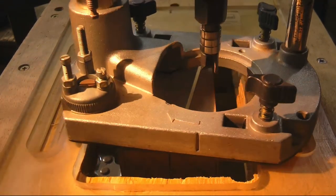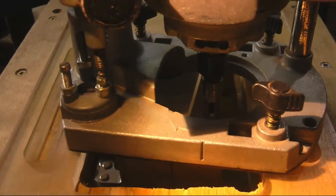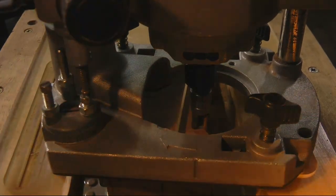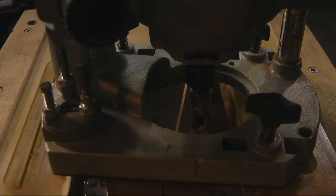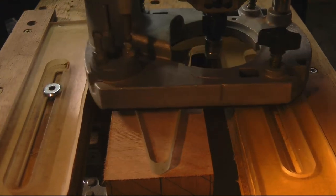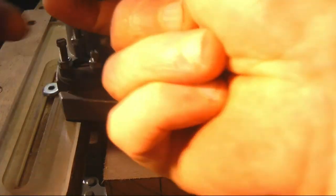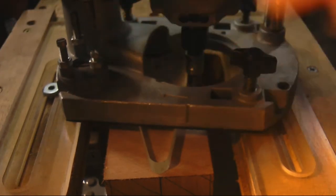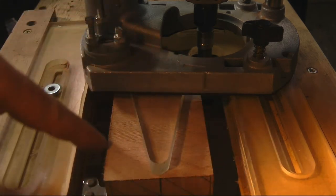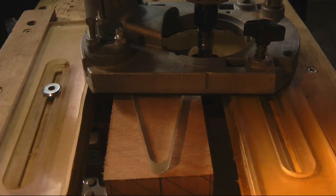So taking the cutter down to touch the wood. Lights everything, isn't it, folks? Hopefully we'll be getting some new ones soon. So zero, I'm going to set it to 14 mil again. The order we do this, it's important. I'm actually going to go around the outside first and then around the inside, and that's to avoid breakout. Mask up, goggles on.